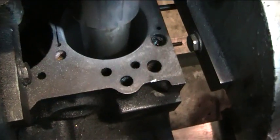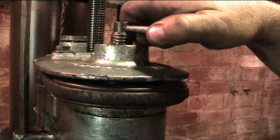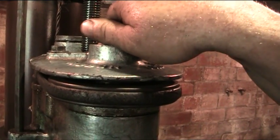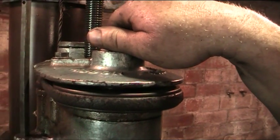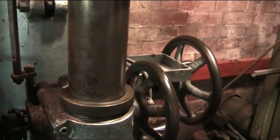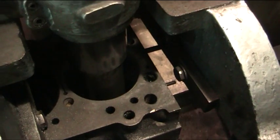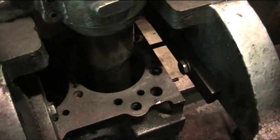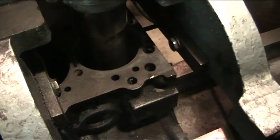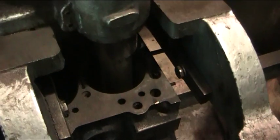At this point we switch off the power for a small while, then we come up to the top and re-engage the clutch. This also, at the same time as engaging the clutch, removes the cutting tool away from the bore so you don't get that nasty cut stripe that comes up. We knock it out of back gear, and then the bar returns. Hold it manually, lock it into gear, let it return on its own speed.